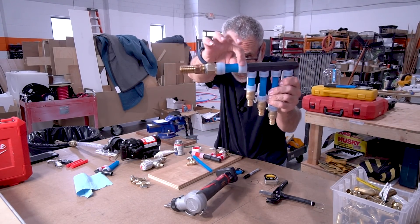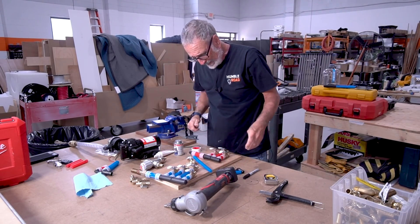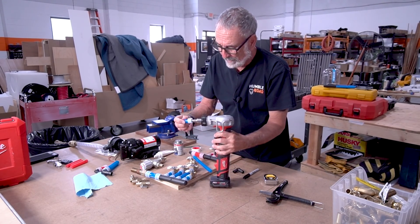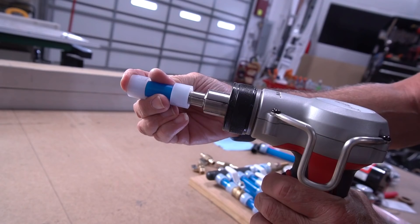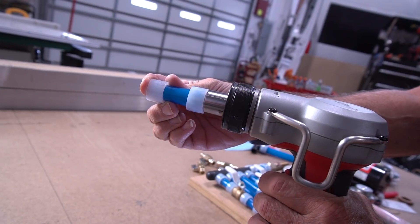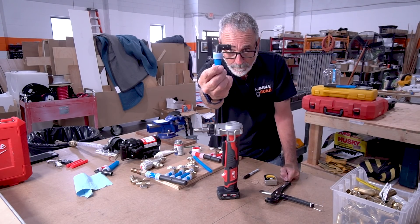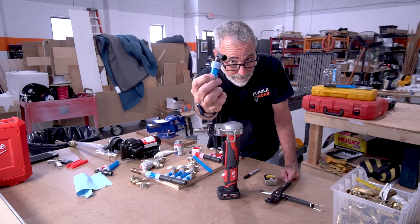The minimum length is two inches for a half-inch pipe. If you have a three-quarter pipe, it's three inches minimum. So I put my collar on my tube, put it in my gun, and I give it six squirts — one, two, three, four, five, six. Then you slip in your fitting, and that's it. Done. Watertight.